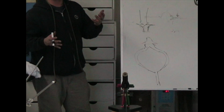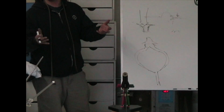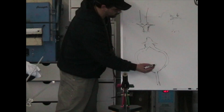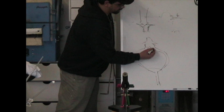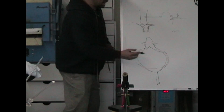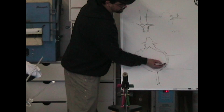Probably blowing it out. I say probably because I waver back and forth sometimes between using the diamond shears and knocking a piece off or blowing it out, depending on what the exact situation calls for. But for speed, I like to be able to flame cut them a lot of times. They come out a little bit cleaner. So to get everything set up to flame cut cleanly and to get it to spin out evenly, you need a thicker wall here in the back, and then let that get a little bit thinner in the front. So when you flame cut it and apply your heat in the middle of the bubble, this thinner stuff will maybe gather down a little bit, maybe get a little bit closer in wall thickness to this.